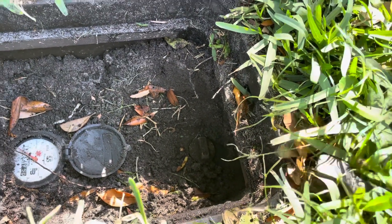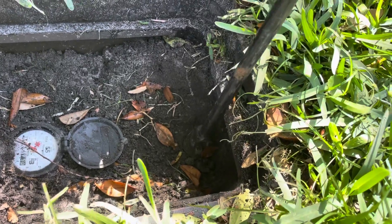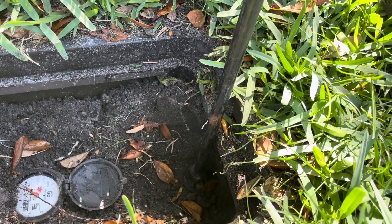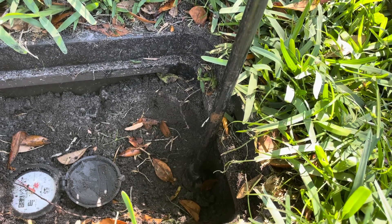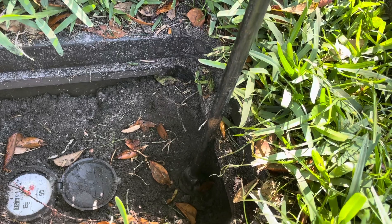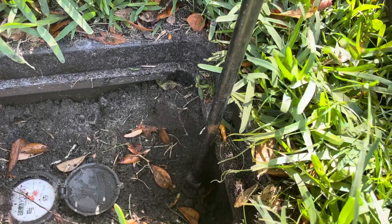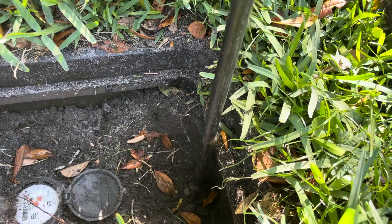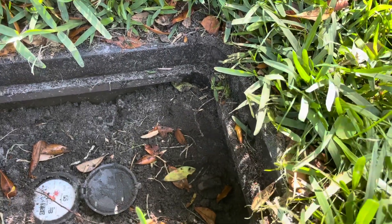When we're done, we're going to come back and it's going to be lefty-loosey. Something to know — a good idea when you're turning it back on — is don't turn it on quickly. Turn it slowly, because we don't want a sudden burst of pressure through the house to create another water leak.